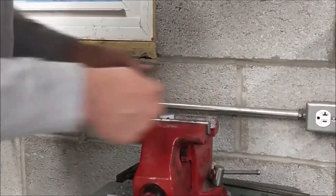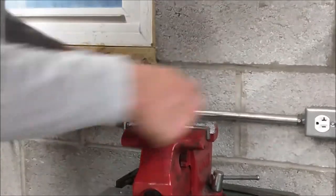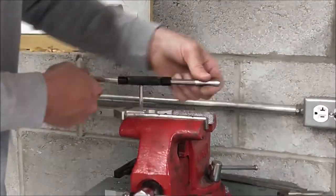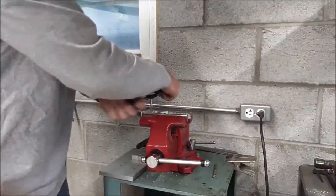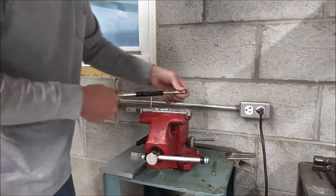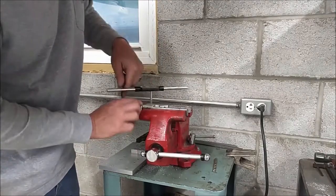As I go through, you'll notice that if it's cutting nicely and breaking the chips properly it goes through very well, because aluminum is not very hard to cut threads into. You just have to make sure it's extracting the chips. A lot of times the chips will fall out if there's a hole straight through — you have to be really cautious with a bottoming tap when there's no hole below to pass chips through. I'm all the way through, so I'm going to back my tap out.